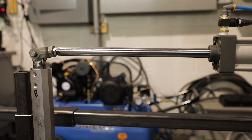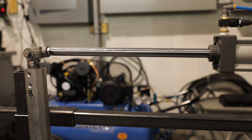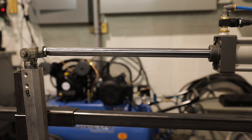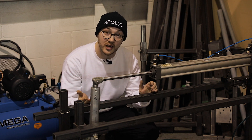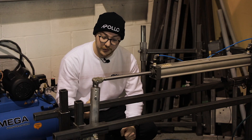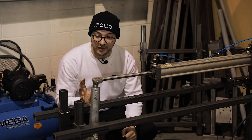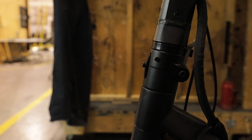In this test, we are pulling 250 pounds on the stem and pushing 300 pounds, simulating the pressure exerted on the stem when you brake — moving forward — and when you accelerate — pulling backward on the stem. So far everything is great, and this just confirmed that we made the right choice by having a thicker hook on the folding mechanism.